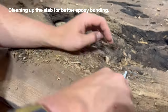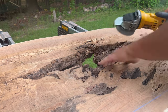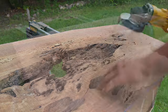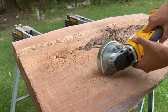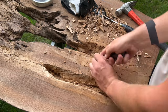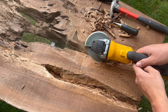Now that we have our dimensions close to where we want them, it's time to start cleaning up the slab. The objective is to clean the slab, remove all the dirt, kick up any loose pieces, and remove the softwood. For the majority of the dirt and softwood I used my angle grinder with a wire wheel disc. The wire wheel did a great job, and any scuffs on the actual black walnut hardwood could be cleaned up with a sander or planer later. Because of this slab I actually bought my first set of chisels. They worked great but were brand new and very sharp — for this kind of work you should probably use old ones. It's a perfect example of how much softwood was on this slab; I essentially created a whole new valley that epoxy would go into.